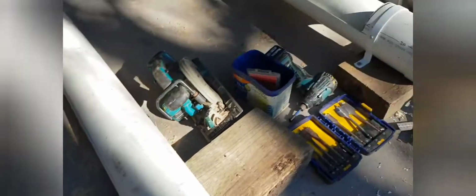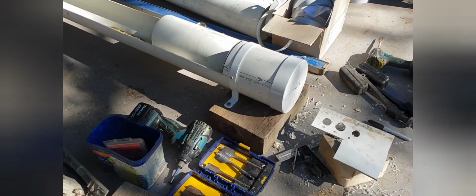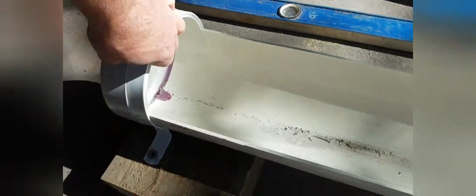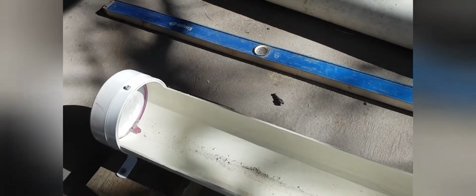We've put our end caps on. Now I've cut these. You could do these though. If you can find these 100 by 100 blocks treated pine, you can use them as the stands, or I've just used 75 by 200 sleepers, and I've cut them down. They're 300 wide. Okay, so they hold the bases on. Now I've just used a batten screw just there to hold it down. It's pretty strong. And then I put the bracket over the top.